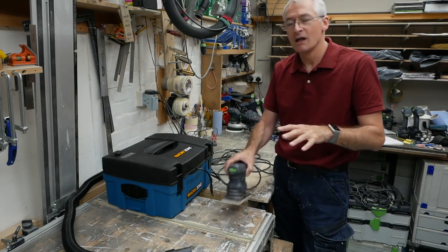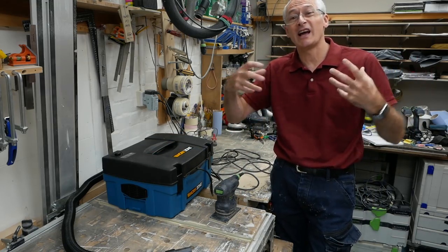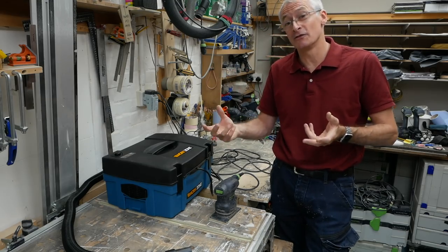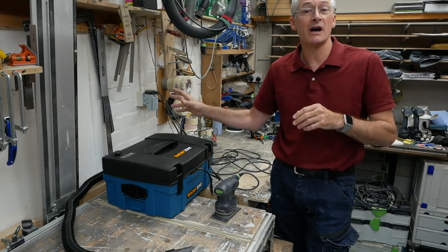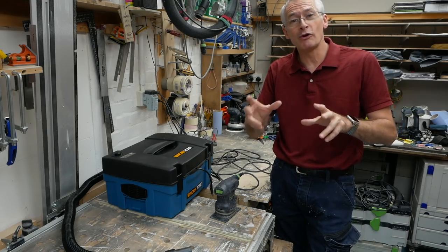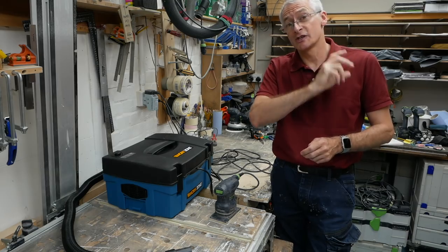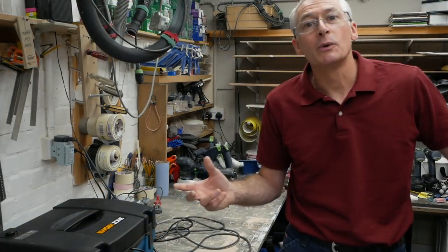So you can clear whatever's in the hose. There's obviously a bit of a delay between switching the power tool on and the vacuum coming on. The Festools are better — they're not instant on, but they're definitely better, probably because they have better circuitry. This is just something you have to live with unfortunately. It's the only way I've come across to get this to work, and with a delay of around 3 to 5 seconds it's one of the fastest I've come across. If that's going to drive you nuts, don't use it. If I'm making lots of small repetitive cuts on a mitre saw or with a track saw, even with the Festool's relatively fast response, I tend to switch the vacuum to permanently on. But if you're working up a ladder away from the vacuum, or the vacuum's tucked away under a bench, that few seconds delay shouldn't really bother you.